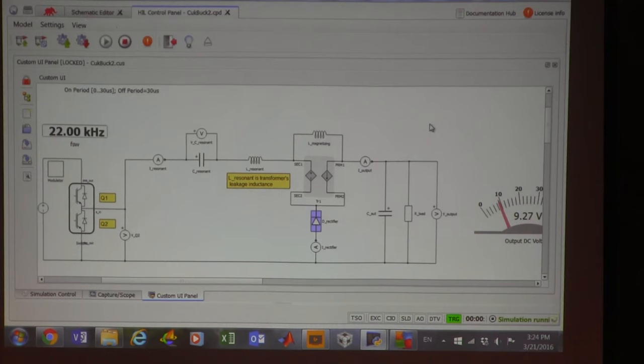We only had a couple of days to do this because the work was transferred from Novi Sad to Boston to here. My guys were working through the night. I originally asked them to do constant switching frequency with variable duty ratio, but what they implemented was constant off-time and variable on-time.